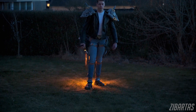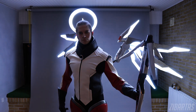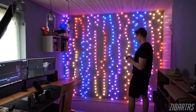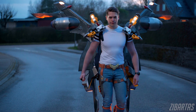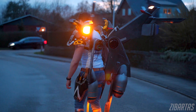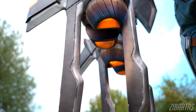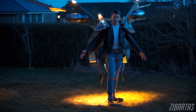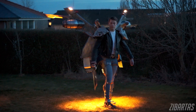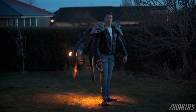Chip-on-board LED animations. The LEDs used in the Pharah jets are similar to the ones I used for my Mercy wings, which are not programmable per se, but with a high-powered MOSFET and some Arduino magic, I managed to get some basic animations. I made them have this idle rumble flicker effect when they're idling, and then a full power jet roaring effect when the wings are extended, with a fade-up and fade-down transition in between.